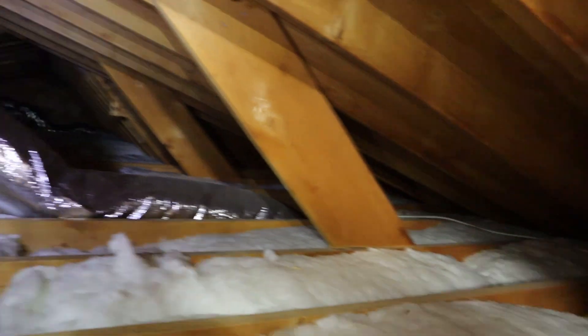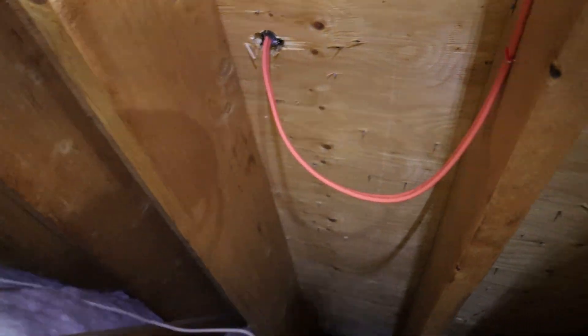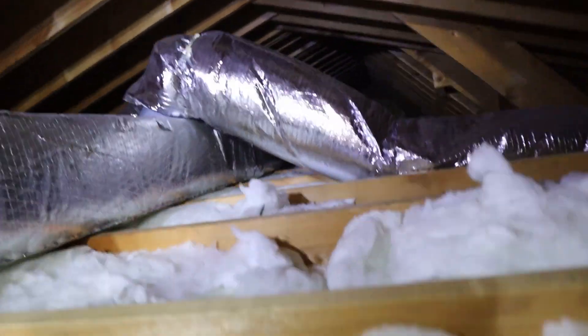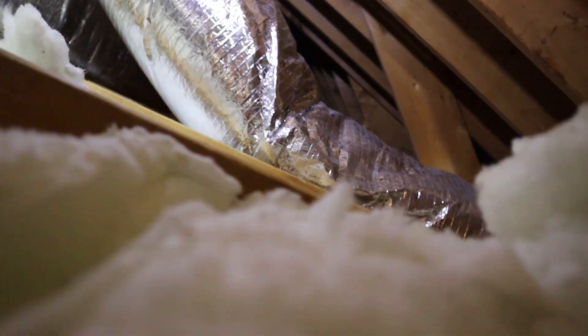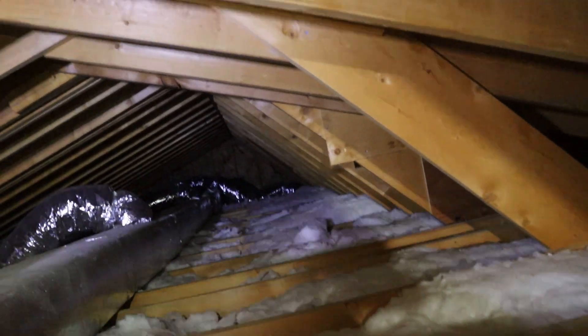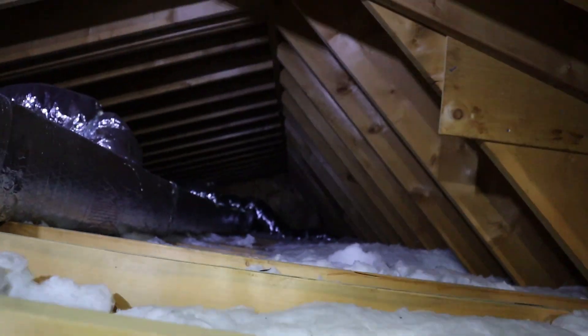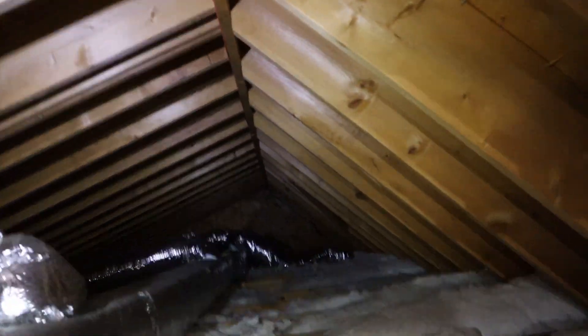Here we are in the attic space underneath the arrays. You can see that's where one of our wires comes out into the back of an electrical box. With this system, since it's AC power, we can run interior AC wiring, which we secure to the top ridge plate there. We're going to crawl deep down into this attic to finish showing you the rest of the conduit run — somewhere that few homeowners ever really need to see, but we're going to give you the full tour because quality is our primary concern.